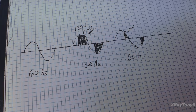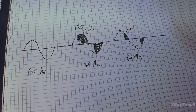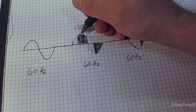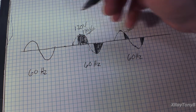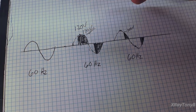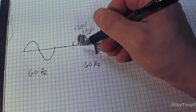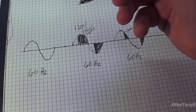That's how this little circuit regulates voltage - pretty ingenious after I really looked at it. This transformer actually can output a higher voltage with no load than you need. There's an adjustment - a power supply adjustment - on all of these amplifiers. There was one on the M400 cube amp, another in the Silver 9Ts. Those adjustments, and the manual warns to be careful, allow you to set the maximum point at which this turns on. If you turn that pot too far, the power supply will even exceed the maximum voltage rating of the capacitors, causing them to fail.